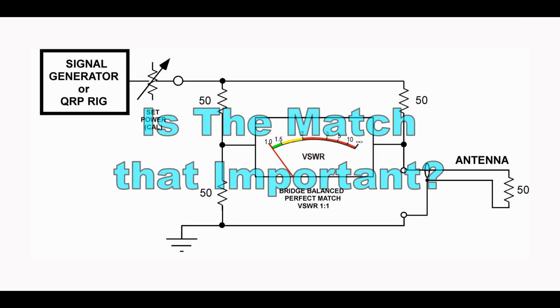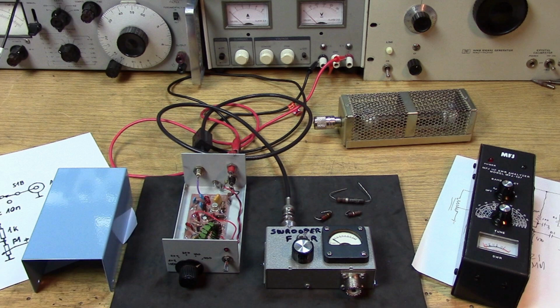However, in the real world, coupling into the loop for maximum efficiency, as with a transmitting loop, drives some considerations for coupling that can skew the two. With a receiving loop where balance and noise rejection are the paramount goals, loss and lower Q can be more tolerated. So with many practical transmitting loop feed styles, the point of lowest SWR will not always exactly coincide with the point of maximum reception.